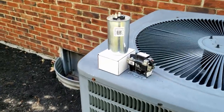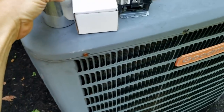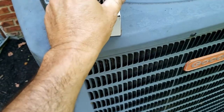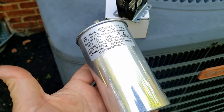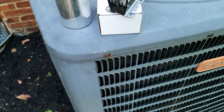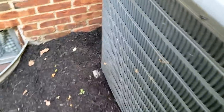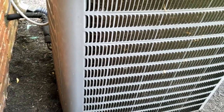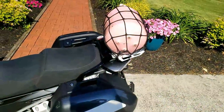All picked up, good to go. Basically all we had was two bad components. Moral of the story: collect all the evidence, build your case, make sure you've got all the clues. The capacitor was the main thing that took it out — how this thing was even running, I don't know. It had a bad capacitor, but refrigerant charge looks fine. Superheat's a little low — about 6 degrees — but it's a Goodman, so you know it happens. Coil isn't too bad. I'll tell him to keep an eye on the cottonwood with all the trees around here.